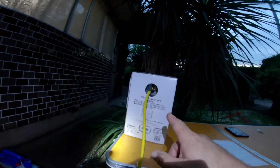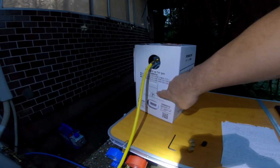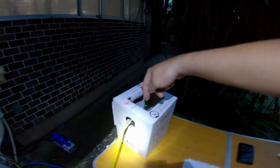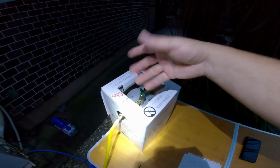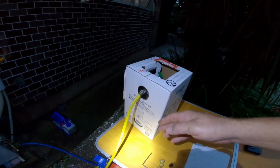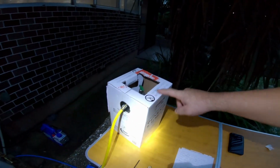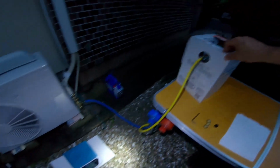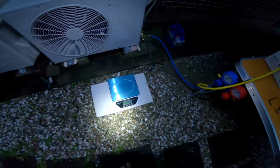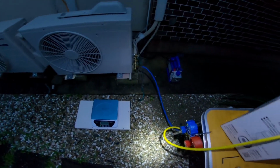The next thing is to take our tank of gas and we're going to invert it as the imagery shows here. R32 gas without a siphon hose. So there's no hose from the valve here extending into the tank where the liquid gas sits on the bottom. There'll be a vapor on top and liquid on the bottom, especially as you use it down. So we're going to invert the tank. It says leave it right in the box, use it right in the box, so that's what I'm doing. I'm going to put it on my scale. Once it's stabilized, then we'll zero the scale out and go from there.